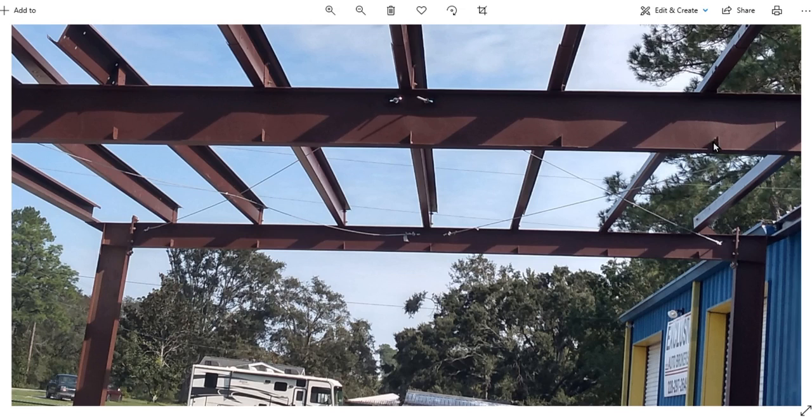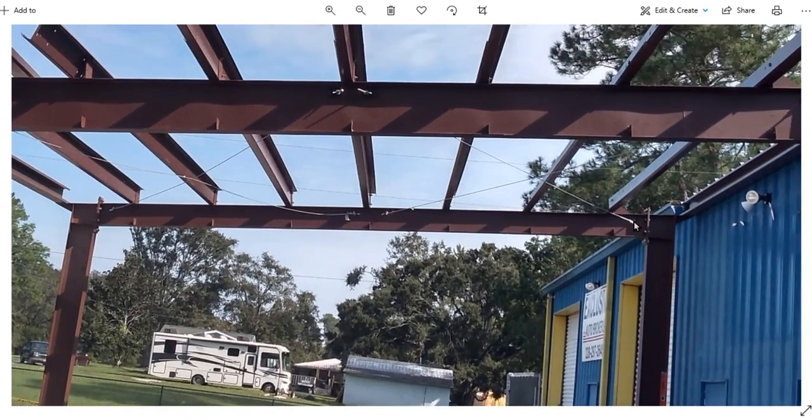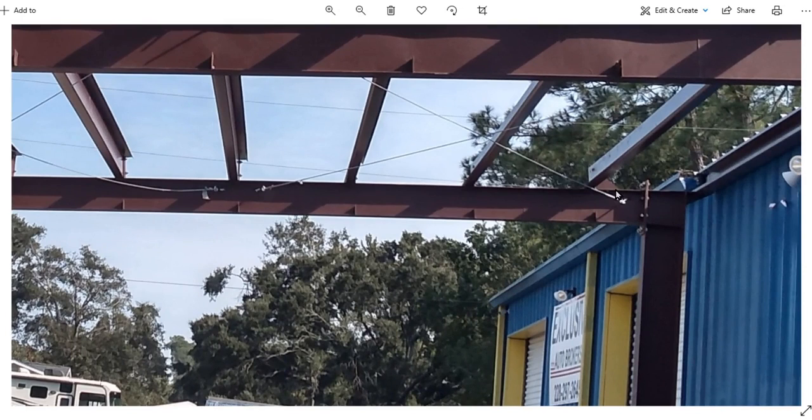They made a mistake — they were supposed to send an extra flange brace. You always want to put these in while you're going too. There should be one coming from the purlin to the rafter on each one of these, but they didn't send 21 of them. So it was a little hairier — I made sure I had everything tied off. But I got all this red iron up and finished this up this morning and tightened up on these braces.